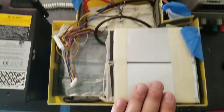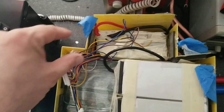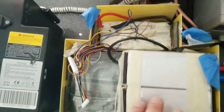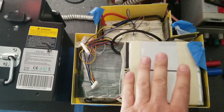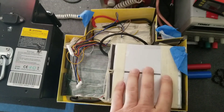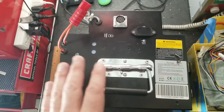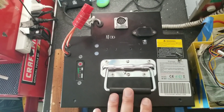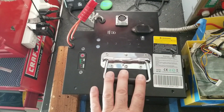These cells cover basically the entire space in here, and the old BMS is pushed all the way up top. This battery pack is almost 24 amp hours of power. I put it on a scale and it's close to 26 pounds as it was before. This upgrade — with the case, BMS, and all the components inside the cage — brings it to 32 pounds, but the capacity went all the way up to 38.4 amp hours, which is huge.